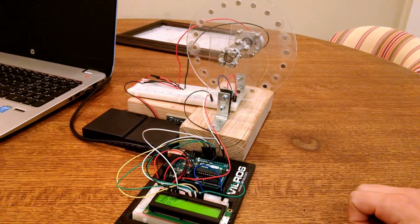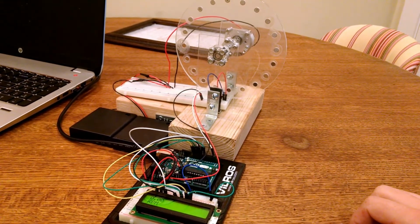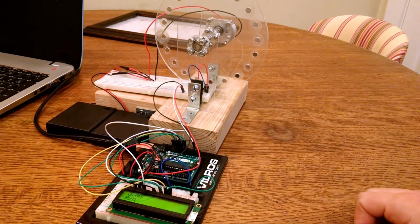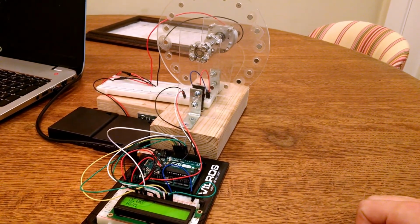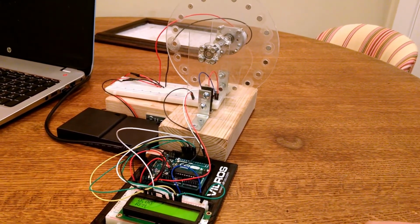Hall effect sensors are really great in industries, like the automobile industry, because they work in hostile environments. It doesn't rely on optical image sensing, so if it gets dirty, it doesn't even affect it. It just relies on the induced magnetic field when a magnet passes by it. So really great technology, and that's how a wheel speed sensor works. I hope you enjoyed my video.